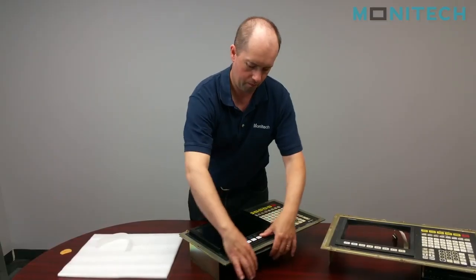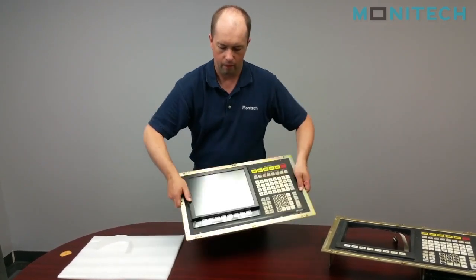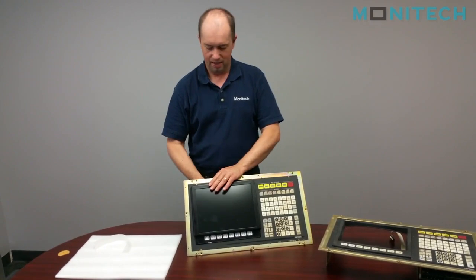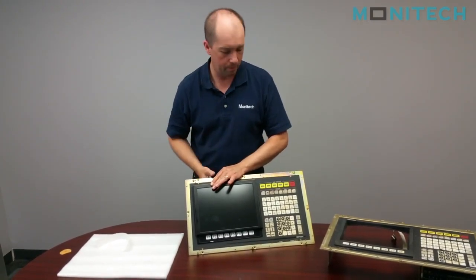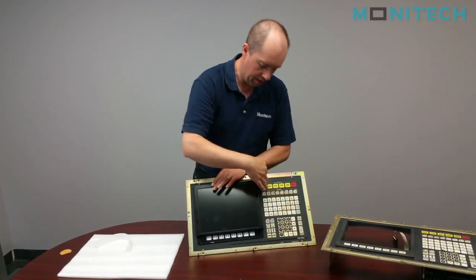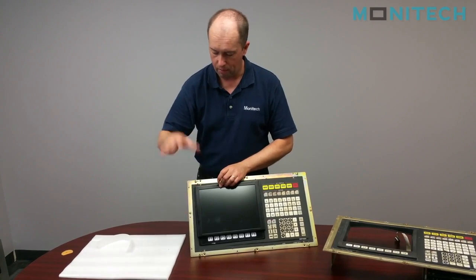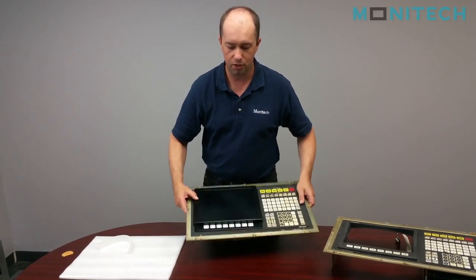That's your OSP. It's a little loose because I don't have these controls attached, but nice and tight once they are. Just go around with a screwdriver and tighten everything up and it's nice and flat. The pressure of everything pushes down and creates a nice seal along the edges, keeping oil and dust out. Then you can put it back in your machine, put the plastic bezel on it, and start running your machine.